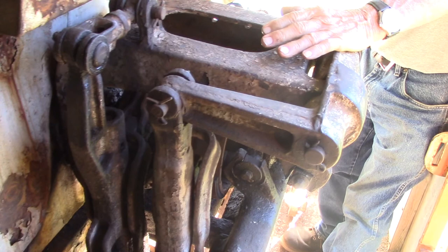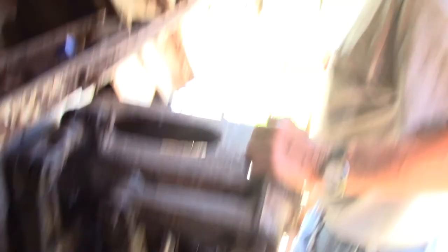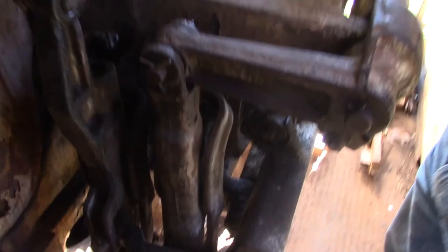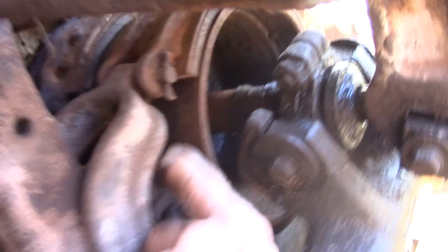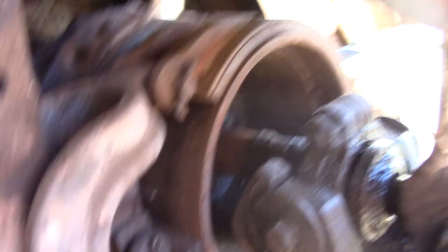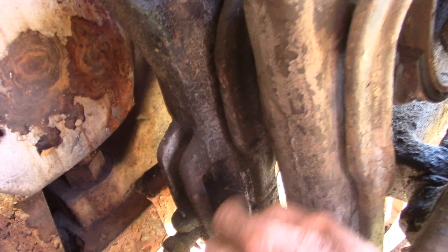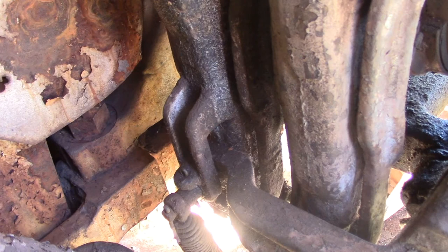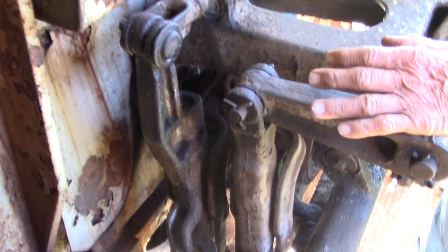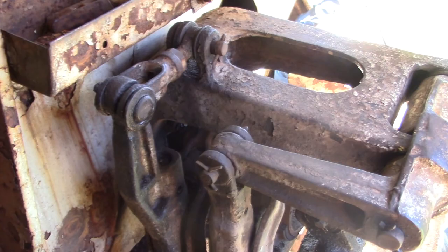For the brake adjustment, it's 7/16ths of an inch. When you adjust this clutch — you pull this pin out, pull that lever down, it'll be disconnected. There's a shoulder where my finger is — it's got to have a set of 7/16ths; that's the right clearance. It has to have seven-sixteenths so the clutch can't go over center and lock itself in. If it went over center without that clearance, it would pull hard on that drum.